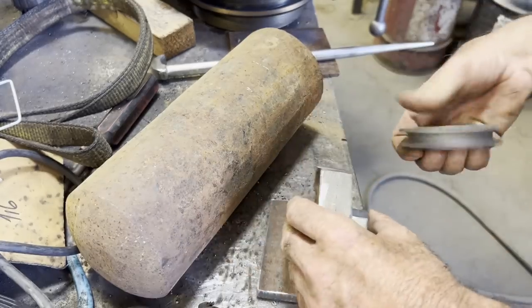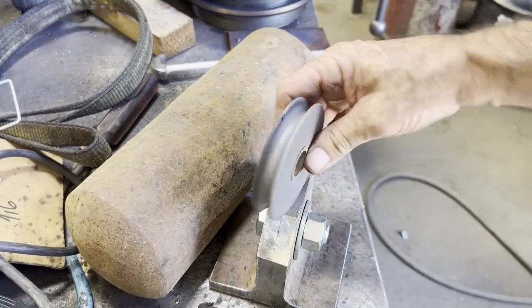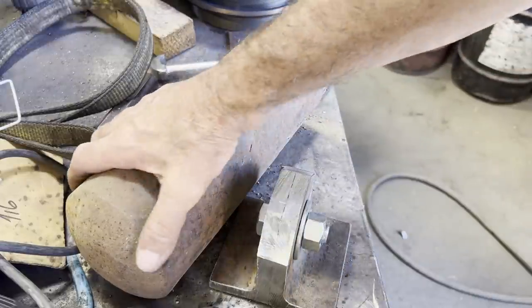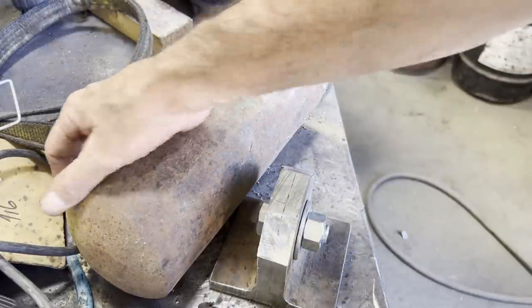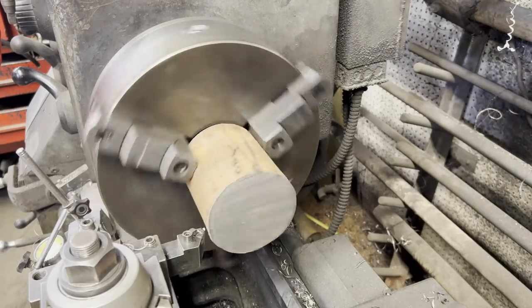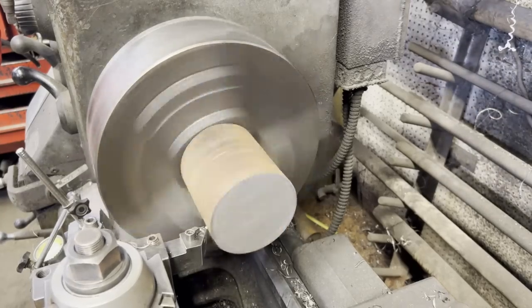When I first built this, I put just a single pulley up on top. And now I want to start pushing the limits on how heavy I can load, and to take some strain off the winch itself, I want to start splitting the cable. Every time you split the cable, I believe it cuts the load in half.